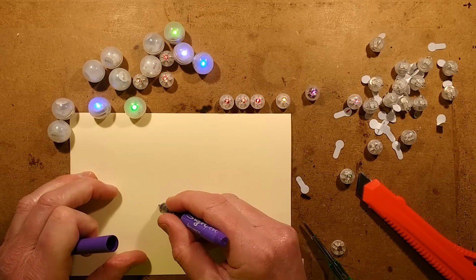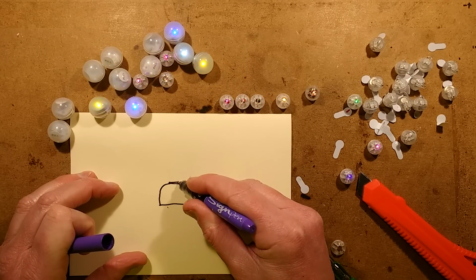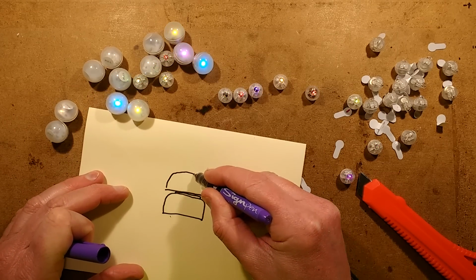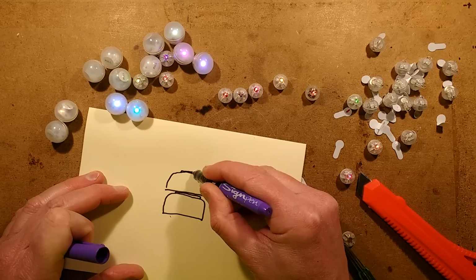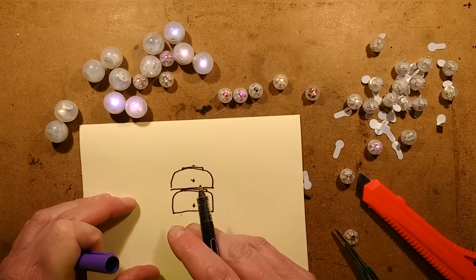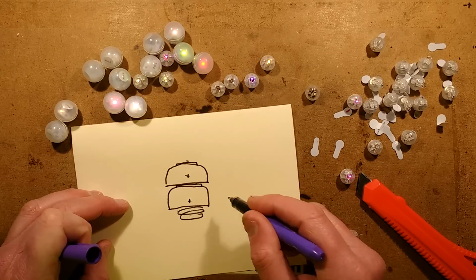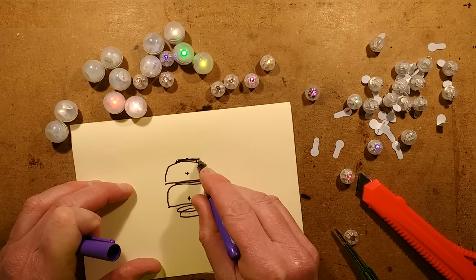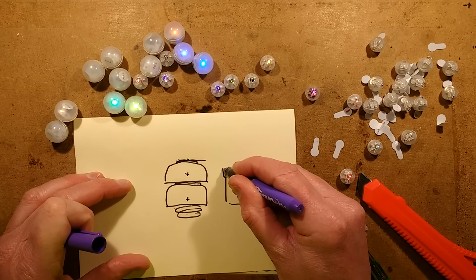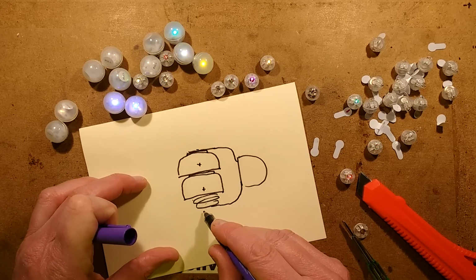you've got the standard little battery shape, with a little dome out the end there. And then another one. So that's the positive contact, negative contact, positive contact. And then at this end is a spring. And then the LED is literally just going like this. If this is the LED here, its legs are bent out like that and like that. So the spring provides pressure against the leads all the time.